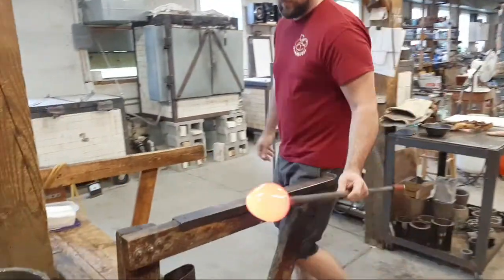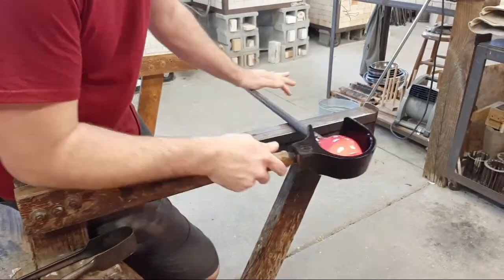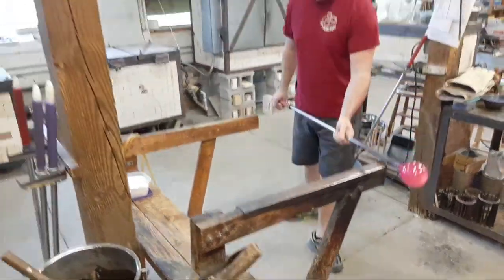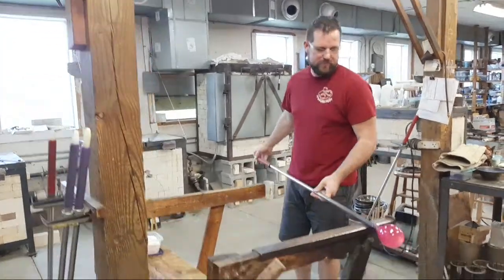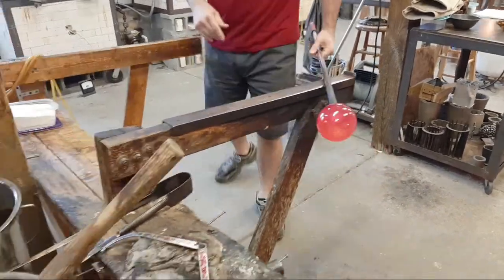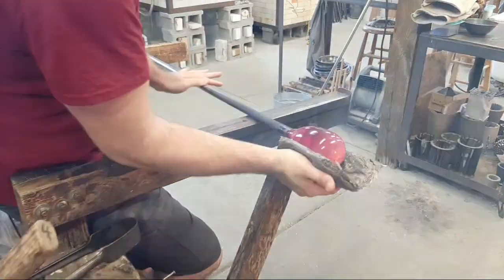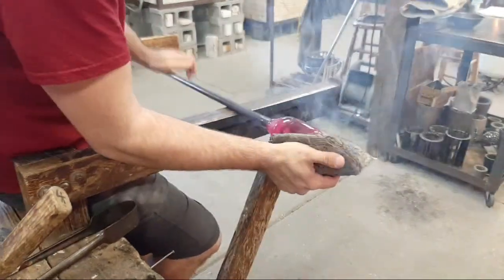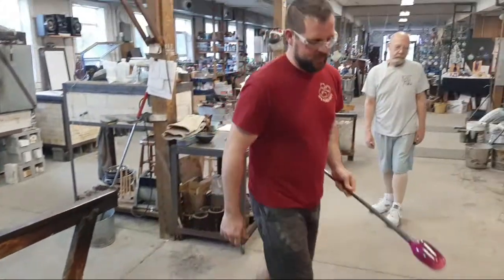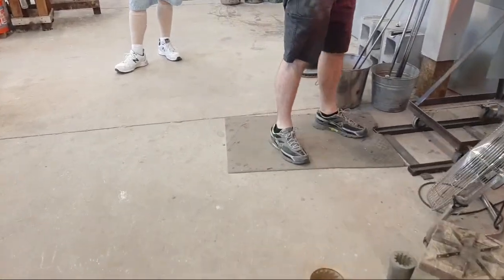The glass looks almost completely coated in color. All colors look a bright orange from the glow of the metal oxides due to heat, but as it cools in that wooden block you can see the color change dramatically — it darkens. He'll blow again, cap the pipe with his finger, and you'll see the diameter increase. He's now using folded newspaper — about seven sheets of standard newsprint folded tight and then wet — it makes a perfect insulator and protects your hand.